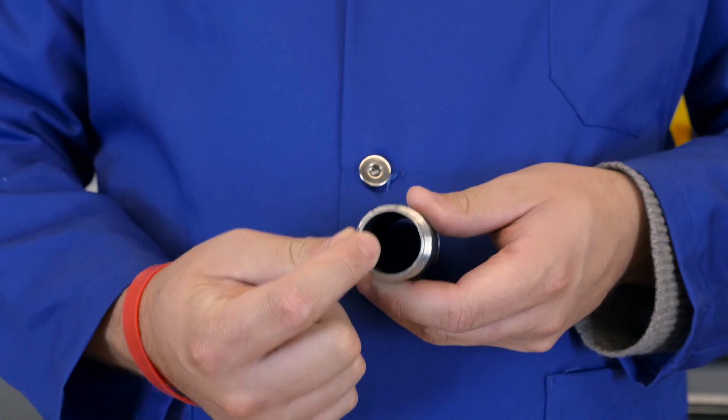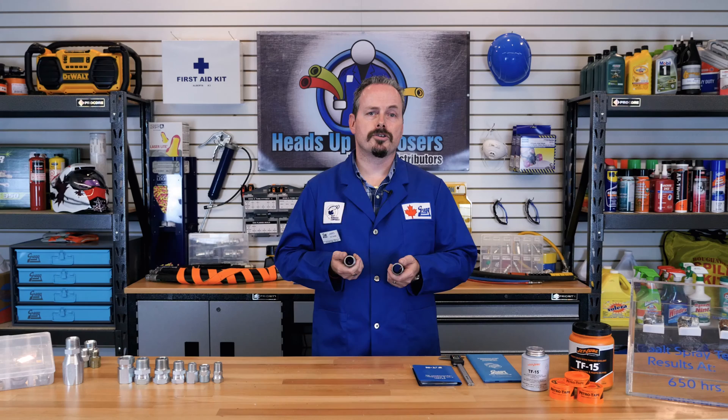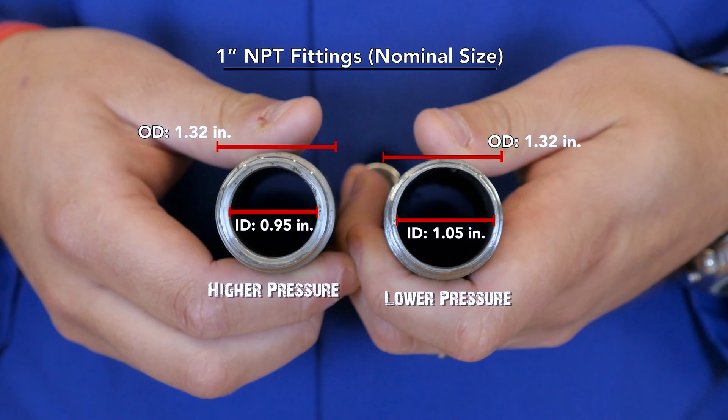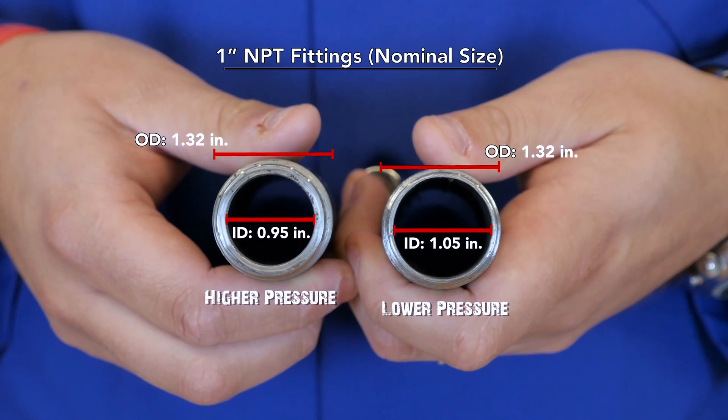To measure pipe threads, you need to have an understanding of nominal pipe sizes as well. Nominal pipe sizes are confusing because they are based on an antiquated method of measuring pipe and fittings. Long ago, when pipes started being made, they were measured from their inside diameter, so a 1-inch pipe measured 1 inch on the inside and 1.32 inches on the outside. When different applications called for higher pressures, they could not change the external dimensions of the thread because the pipe had to work in all the same situations. Instead, they opted to make the inside diameter smaller. This means that today, a 1-inch NPT fitting may not measure 1 inch anywhere on the fitting. But it's a mouthful to call a 1-inch fitting a 1.32 or a 1-5/16-inch fitting, so instead we opt for its nominal size, or in name only, for simplicity.